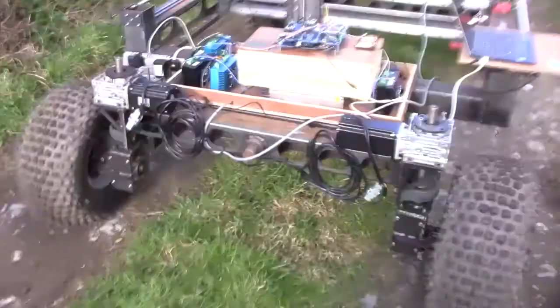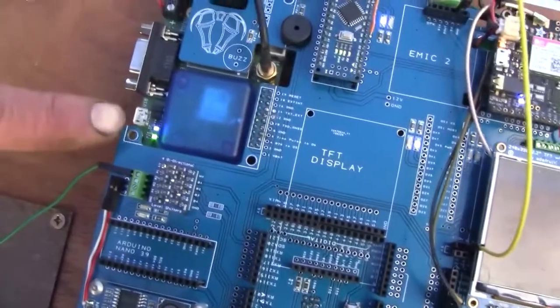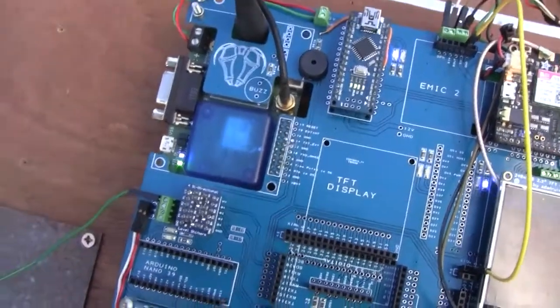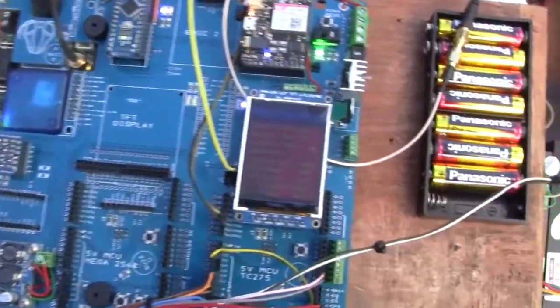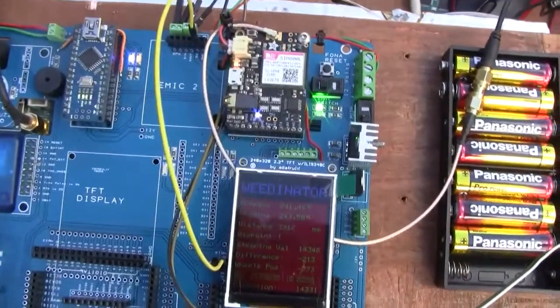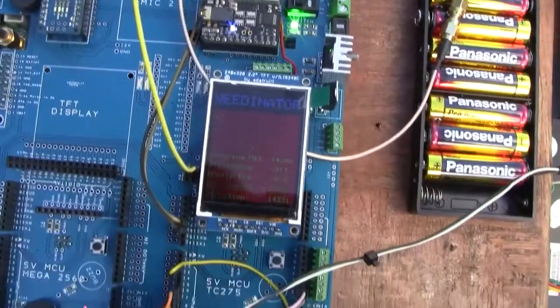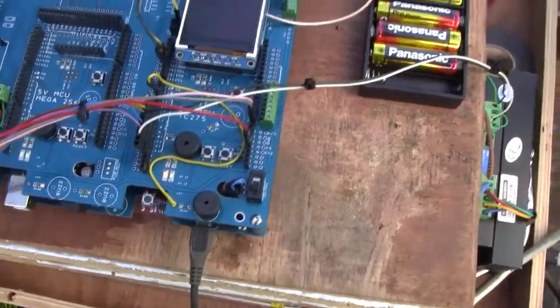So let's have a look at the machine and see if it's all set up right. I've given it a bit of time for the GPS to connect, and looking at this green LED here, we've got a static green LED on the U-blox which indicates we have an RTK fix, which is really good — it should get super accuracy with this. All the other LEDs are flashing as they should do, indicating that all the modules are working, and there's that beeping as it should do.